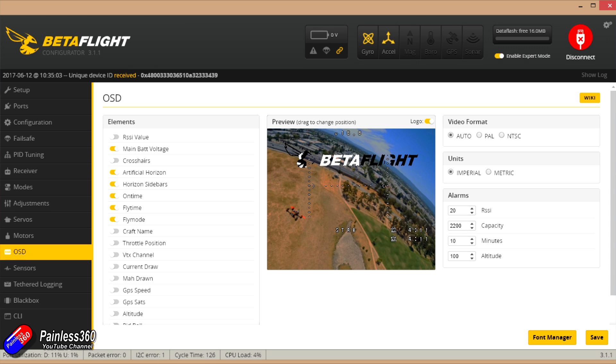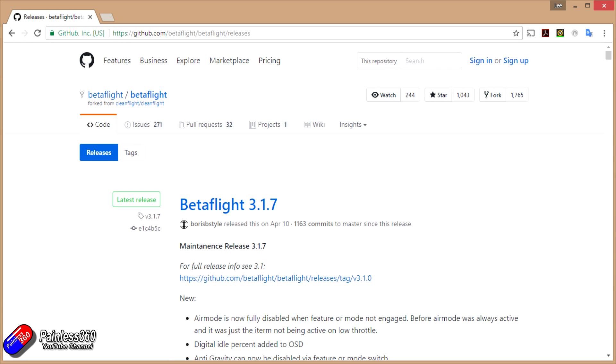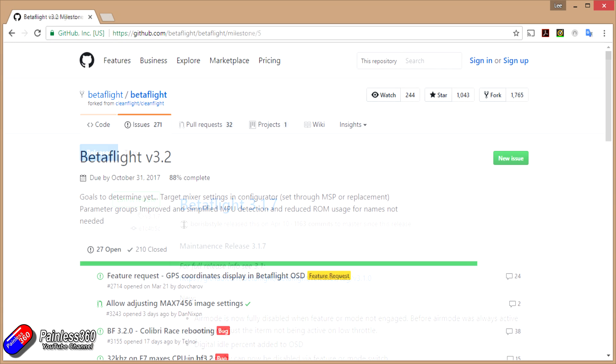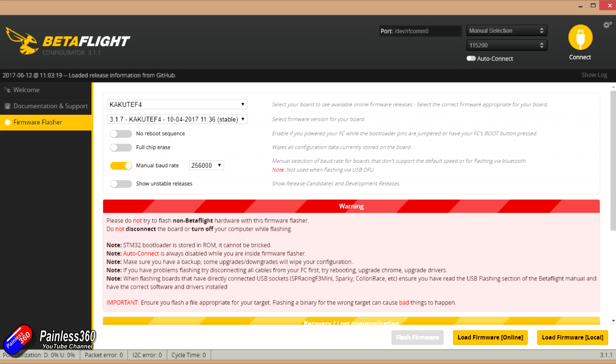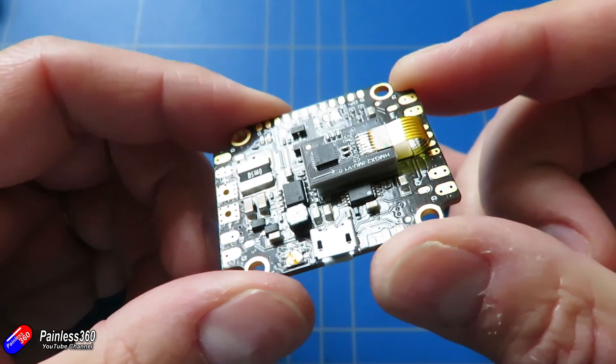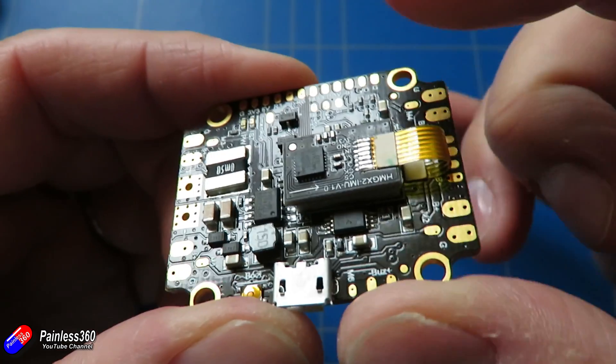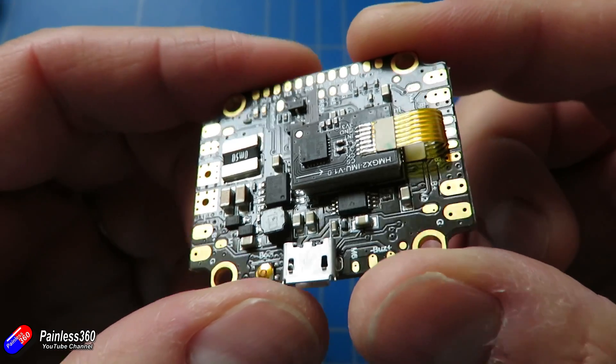The on-screen display is laid out and this is very different from a vanilla install of Betaflight. The last thing I did — which was the other surprise — was go into the CLI and ask it what version was running. It came back with Betaflight 3.2. As I'm recording this video, Betaflight 3.2 isn't out yet — if we check the GitHub repository, the latest version is 3.1.7, and 3.2 isn't due until the end of October. So this board is coming with a pre-release version of Betaflight — just be careful of that.